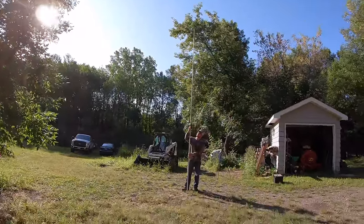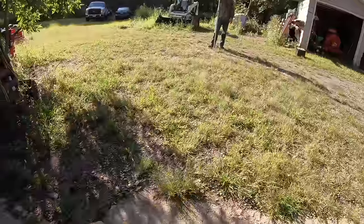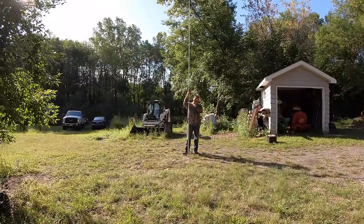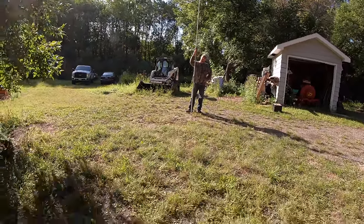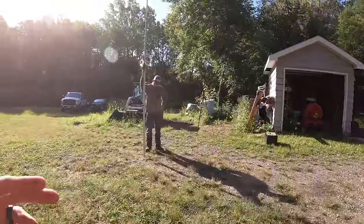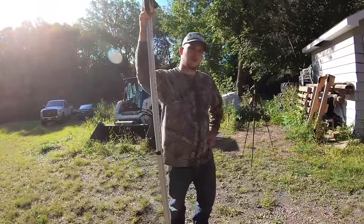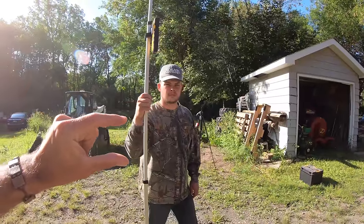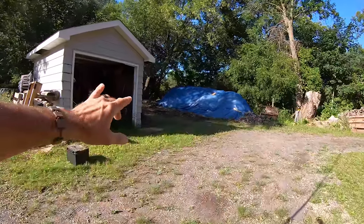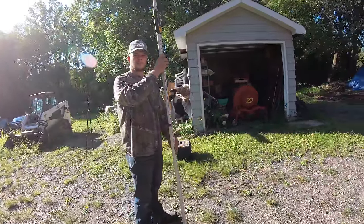Let's read the grade at the work zone. We're at six foot three and a quarter of an inch. So we're one half inch higher than existing grade at that point, and we need to get two inches below our benchmark mark out there. That means we've got to cut about two and a half inches total, but blend it across the whole area and match it up around both sides. When you're running the loader and you cut out five inches you'll know that's way too much.